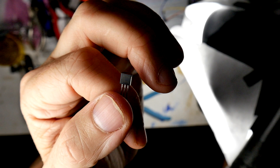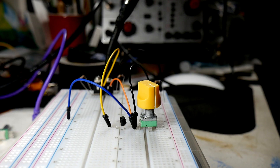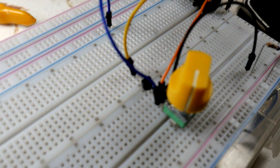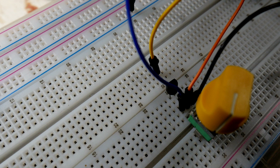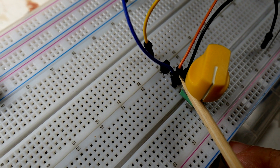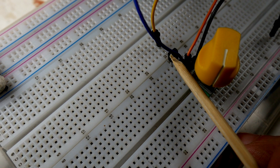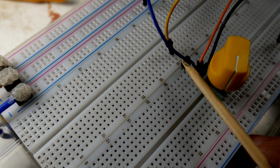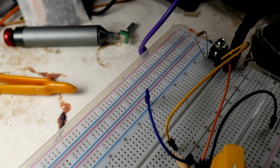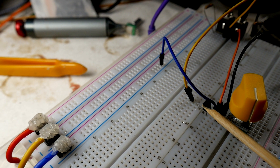I'm using an unusual component here — it is a MOSFET, the 2N7000G MOSFET. I have a potentiometer and a MOSFET, with the drain and source connected to the 5-volt power and the wiper of the potentiometer, so it's acting like a variable resistor. What's neat about MOSFETs is that they're voltage-controlled resistors, as opposed to a regular transistor which is current-controlled. This thing draws literally no current unless something goes wrong. I always put current-limiting resistors on all my things, but in principle it shouldn't need one.